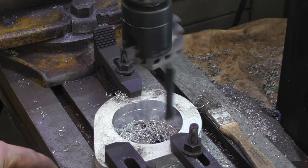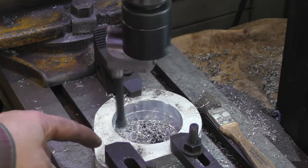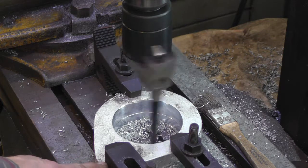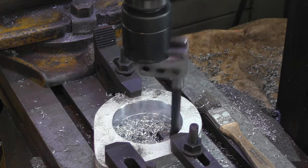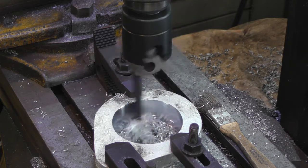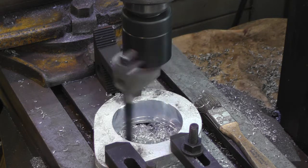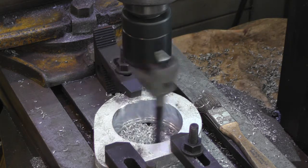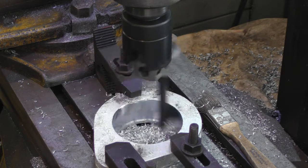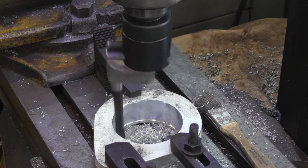Once I get this hole right, there'll be some set screws to hold them in place, mounted on these side pieces. And of course there'll be the hole down through here, one to hold the bearing for the bottom of the lead screw, and one will have a bearing and stuff for the top of the lead screw. That's for lowering the column up and down. And of course I got to vacuum out the center every pass I make too. About a quarter of an inch to go. And there she goes. And just keep going that over till we get the right size hole.